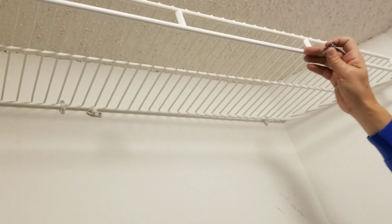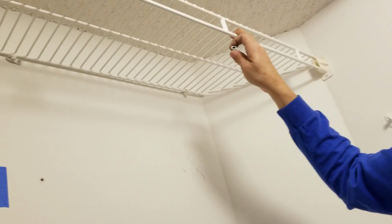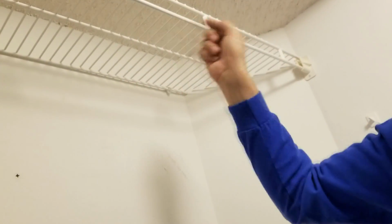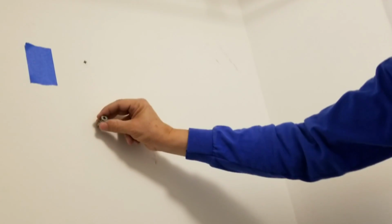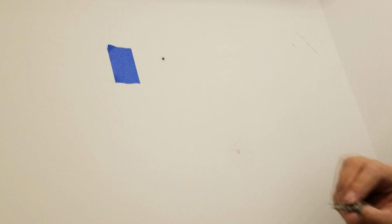The girls get these long dresses and jackets, and some of these clothing items can weigh 2 or 3 pounds each, and you start cramming more and more and more in there to the point that you can't even move your clothes around. That's going to add a lot of weight, and it's going to stress these things and crush the drywall that they're in, and boom, they pop right out.